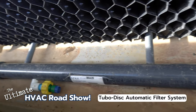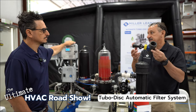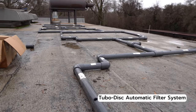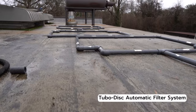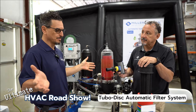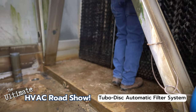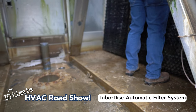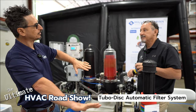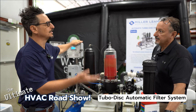With Marley, you can order these directly from the manufacturer and install them — they have a spec we have to follow about the flow and pressure fed to the sweeper system. If you've looked at a cooling tower basin without a sweeper system, the sediment just settles and gathers there. The sweeper system pushes it towards the drain, and if you have something like this on a side stream, it pulls some water out, filters it, and puts it back in.